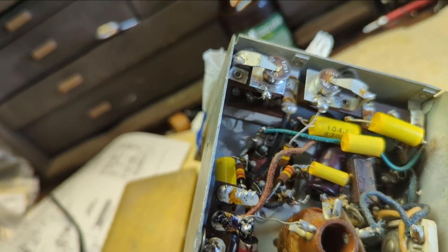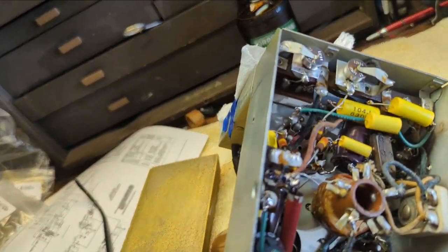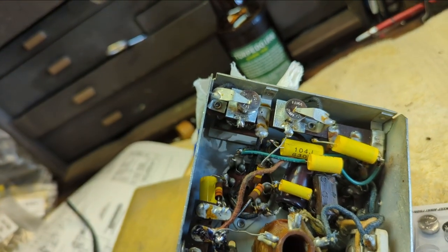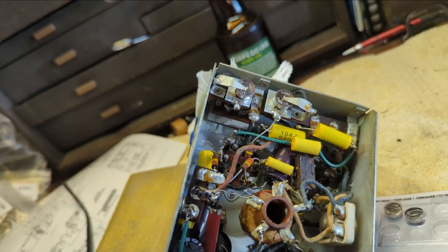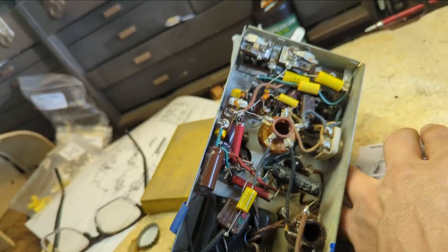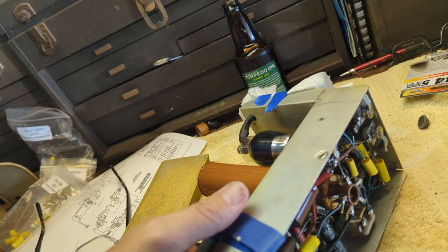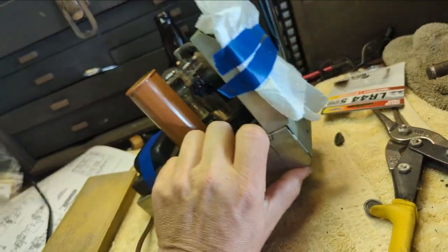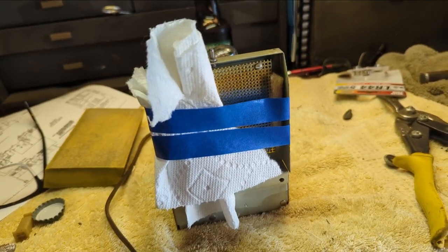And so I cut out these little pieces of sheet metal from a piece of radio, of all things, and sanded it down and soldered them on the ends here. So now it should be providing some voltage to the microphone. Now if the microphone doesn't work now, then either it's out of tune, as in I need to make some adjustments here, or the microphone element's bad. And if that's the case, then I'm probably going to have to call it quits on the project, and I'll resume filming with other people at the museum who will help out with the microphone. But nevertheless, so far so good.